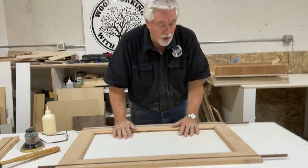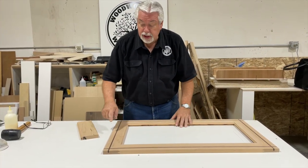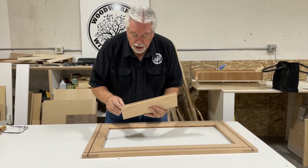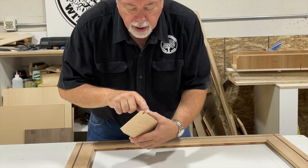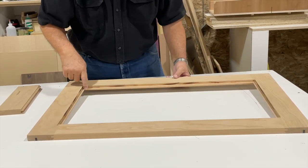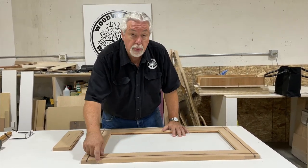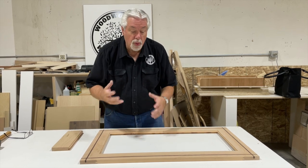It's been a few hours since we glued in our first inlay strip. Since then we have grooved and put in our second inlay strip, sanded it down flush, and sanded the edges. One of the other things I've done is — when we did our stile and rail cuts on our router it left a little lip on the back side with the groove. We have taken out that little lip on the back side to allow our picture and our glass to set inside our frame. That gives us our picture frame look. On our final sand we're going to sand to 180, put a quarter-inch round-over on the edge, and then off to the paint shop for a clear lacquer finish that will really make our colors pop.